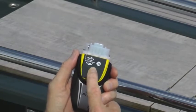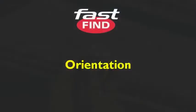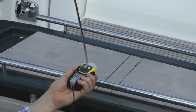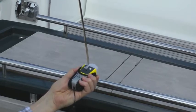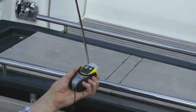Keep the GPS antenna area clear. Orientation: at all times try and keep the antenna as close to vertical as possible. If you're in the water, make sure that the body of the PLB and the antenna don't become submerged.